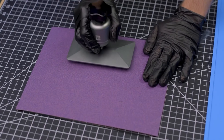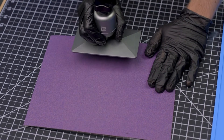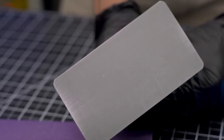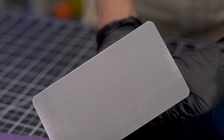Press down lightly on the build plate as evenly as you can and slide it away from you. Lift the build plate off the sandpaper, bring it back to you, press it down, and repeat 4 more times. Take a look at the build plate — you should see the high spots as the parts showing scratches, and the low spots should be untouched and clearly a different finish.